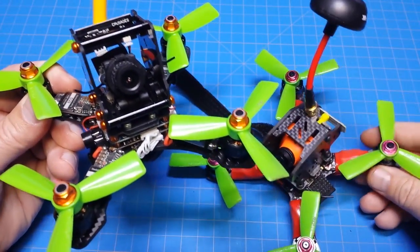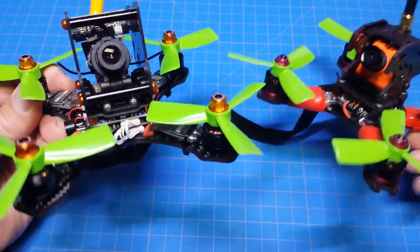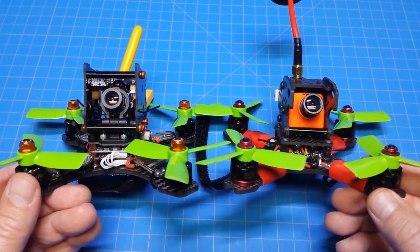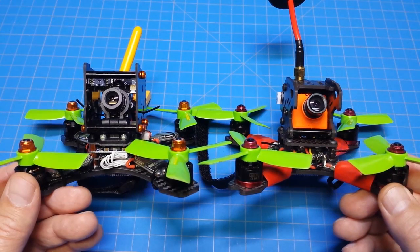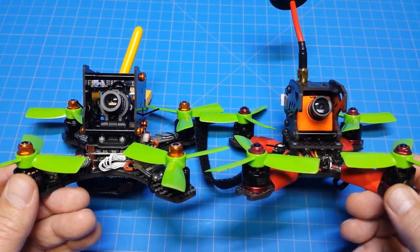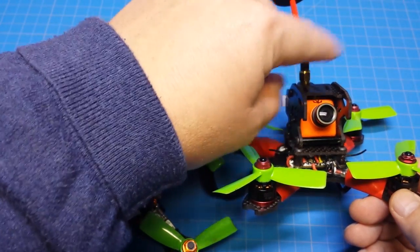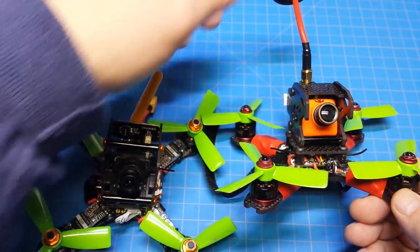You can run 4S on the Crusader and it will probably perform more similarly to this build on 3S. These two are very similar in frame design, though Diatone has their own proprietary parts. My custom 130 stack is quite a bit smaller, and I always like low profile because it gives me less chance of getting snagged on a ghost branch. This antenna is too tall though — I'd like to find good quality short stubby antennas. I do worry that if you catch a short stubby antenna it'll definitely tear off a connector, but I'm willing to give that a shot.